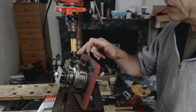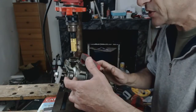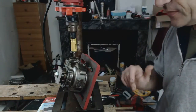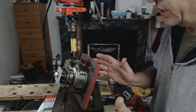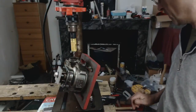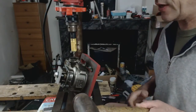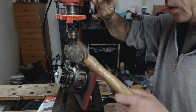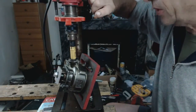This is not central, which is annoying. The exhaust output is not central. So when I originally set it up, I set it up over the cylinder — over the hole running through the bench — and obviously it was wrong. So the only thing to do is to get it reasonably tight and then take your copper and hide mallet and literally tap it, using the smaller boring tool as a guide to try and get it in the middle.